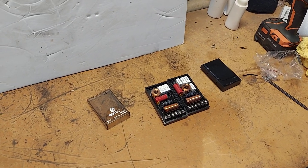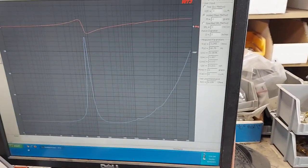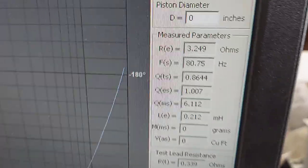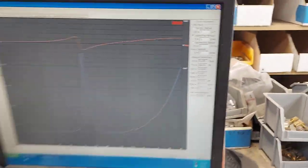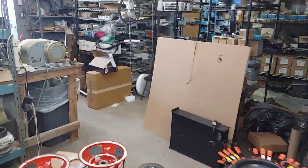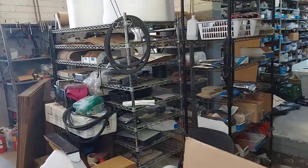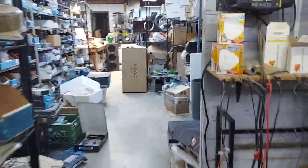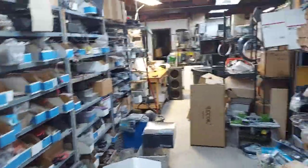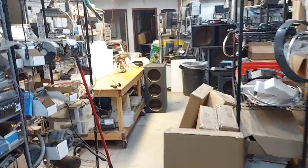I also need to do the 5.25 sweep real quick. As suspected, the FS on the 5.25 is higher — it's at about 80 Hz. Smaller drivers like that benefit from crossing up higher, so I would cross those up at probably 200 Hz without any problems. You can only fit what you can fit in your car. 5.25s are good to use with an adapter.